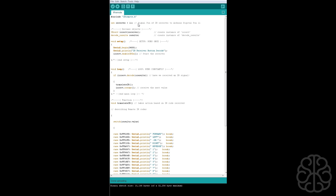Once you've done that, here's the library inclusion. The signal pin for the IR receiver is connected to pin 11. We're declaring some variable objects to store results and the IR receiver setup. In the setup we do a Serial.begin to set up our serial monitor, put a title at the top of the window, and start receiving. In the loop, we check if we've received an IR signal, and if so we call the function translate IR, then get the next value.